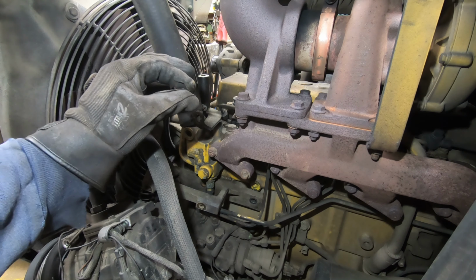All right, so I loosened up this bolt. It's a 15 millimeter, and I rotated the tensioner. It was in, I rotated it out so I can get at the bolt that was right there on this little strap. That was, I think, 12 or 13. So that was holding this side of that tube. The tube runs across, and then it goes right there into the water pump. So I ought to be able to angle it now. So there should be nothing holding it except for where it's sticking in the water pump. So I don't exactly remember doing that last time, but I might have.